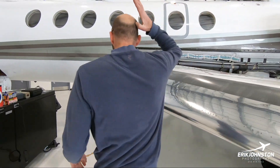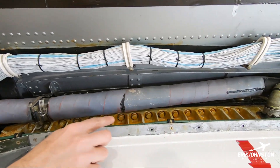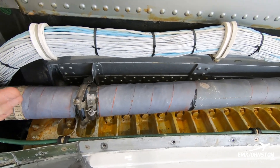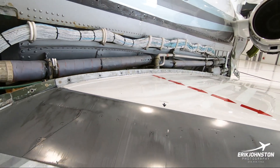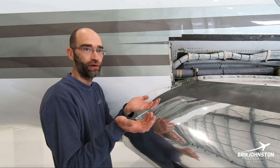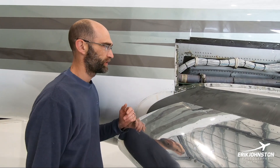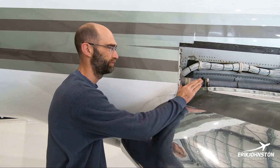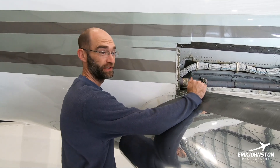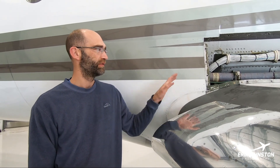On top of the wing root, the panel is off up there. Inside here, there's a bolt in every one of these — we call them bathtubs, but they're wing bolt recesses. That is how this wing is bolted onto the center section. We need to inspect every bathtub because they'll fill up with water and you check for corrosion. You also have to apply a corrosion protective scheme over the whole thing. The old style bathtubs were filled, but now you clean everything out and add corrosion preventative in a couple of different layers.